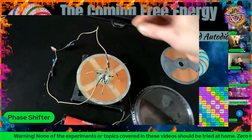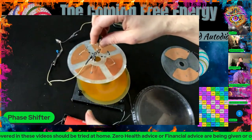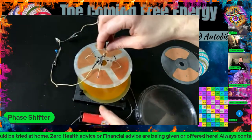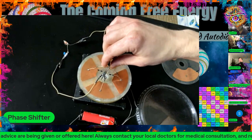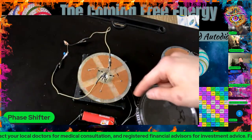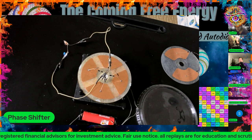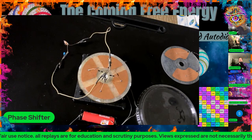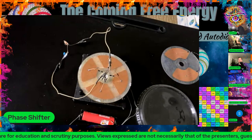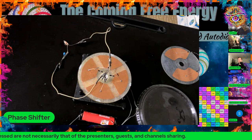Now, here was the weird part. When I checked to see what the load was on that moving disc, and I had this hooked up to a power supply instead of a battery, a precision power supply that gives me my voltage and my current readout, whether or not I had this load hooked up, I couldn't see any load difference on the moving disc. And this system uses no electromagnetic fields to produce the power from the high voltage output. So what that effectively tells me is there's a decoupled aspect of the electrostatic output generated based on RPMs only that has nothing really to do with the input watts dissipated in the prime mover.